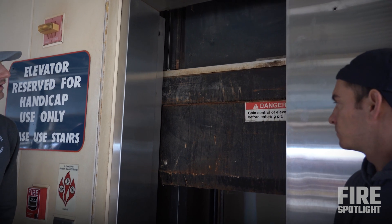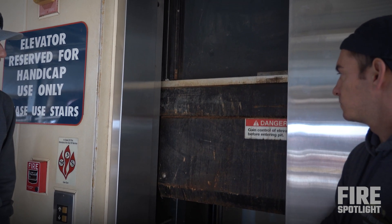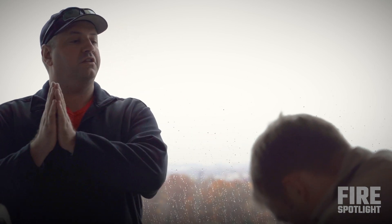The crank or the motor on top of the elevator is going to open the hoistway door with the car door. You rarely ever see the inside of the car door when you're getting on an elevator in normal operation — standing in the hallway, you rarely see it because the car door is carrying the hoistway door over, together. And when the elevator ride is done, it tries to close both of them together.